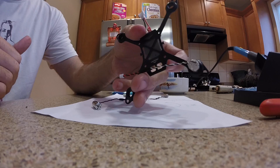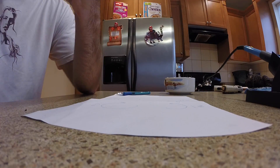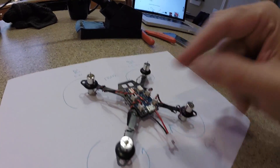These motors are just friction fit and I put them about halfway in so I have enough sticking down to be kind of like a landing leg. Be sure to twist up those motor wires so when you throttle up you're not going to get video interference.